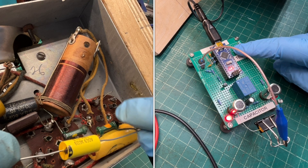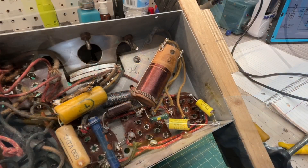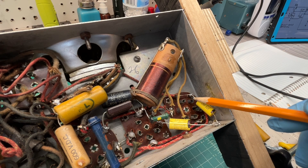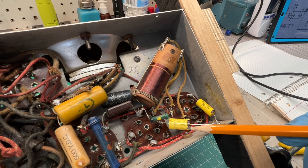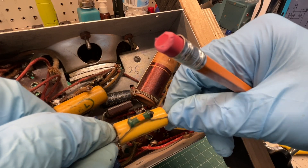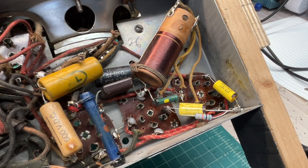For the purists out there, I've already denoted the outside foil or shield side, which will go to chassis ground. I got the 0.06 microfarad capacitor installed. In addition, going back over to the 56 tube, I placed a 0.1 microfarad cap in — one of the ones with short leads, so that worked out great. The chassis serves as ground for this receiver. I also took out the old 0.1 microfarad capacitor along with the 50,000 ohm resistor that was out of tolerance, which will be replaced. Let's move along to the next capacitor and resistor.